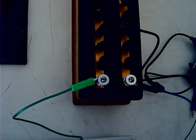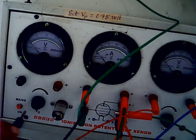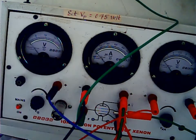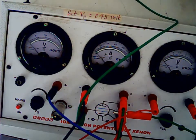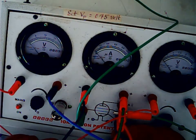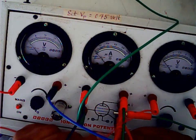From the resistance box I connect to the positive of the grid voltmeter. You can see this is the grid voltmeter — the positive is here. I connect the wire from the other side of the resistance box to the positive of the grid voltmeter. From the negative of the grid voltmeter it goes back to the cathode K.